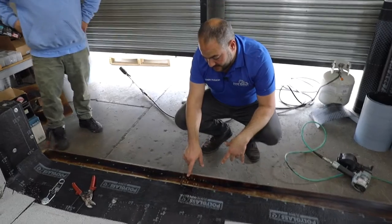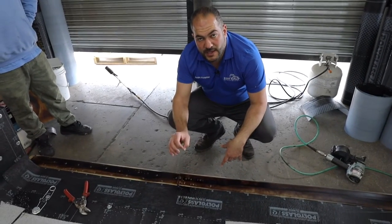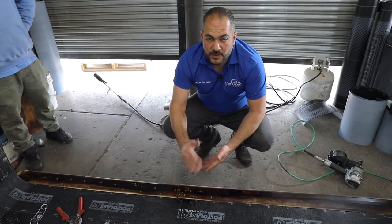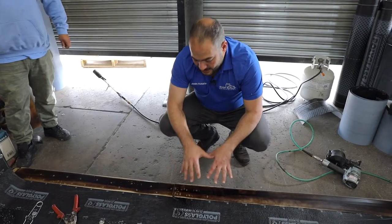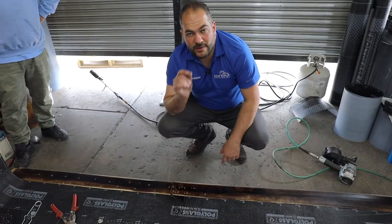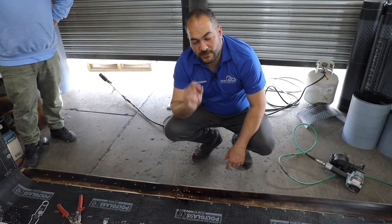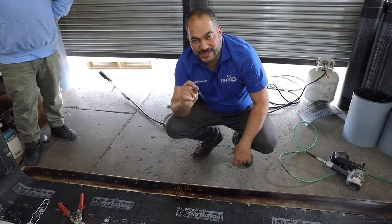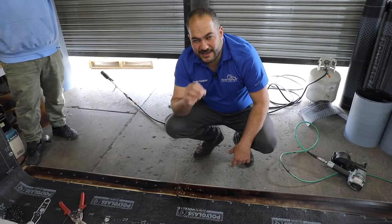What we've just done is sandwiched these two pieces of flashing in between the hot tar that was scraped off the back of that torch-down roll, essentially creating a seamless piece of flashing. This is really the only effective way we've found to make these joints — it's a small step but it ensures the longevity of the roof and a solid, seamless finish.